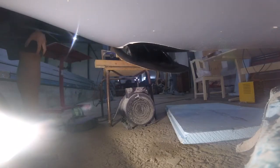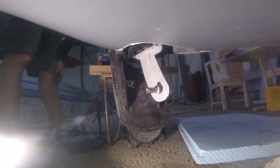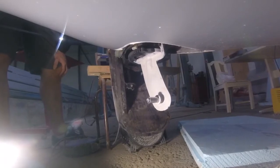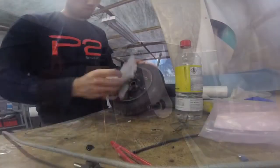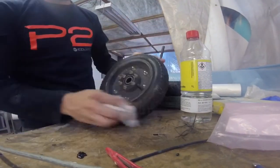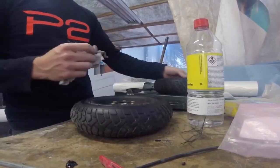We did a full blown test of the retraction just to make sure we had everything in place. You can see the gear coming out while the motor drives it down, and this worked quite well. The motor was free and went into that small cup up in the bulkhead which we had made. We could then prepare the wheels — and the wheels on this aircraft are basically twin wheels, two wheels on the nose gear, to make it simpler to rotate them, like an airliner in a way.